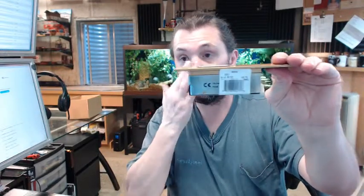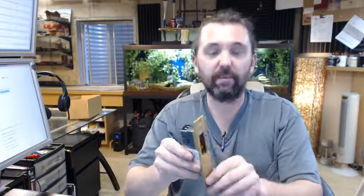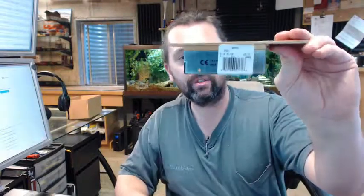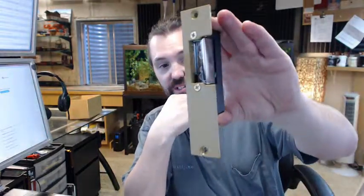There is a link below this video to the template, and the dimensions were right on in terms of the width, height, and depth. If you have any questions on mortising, feel free to reach out to me — I have mortised electric strikes lots of times and would be happy to give you my opinion. If you have any questions on the Trine number 2001-6-14AC electric strike in a brass finish, or any other Trine product, please feel free to reach out to us. Thank you.